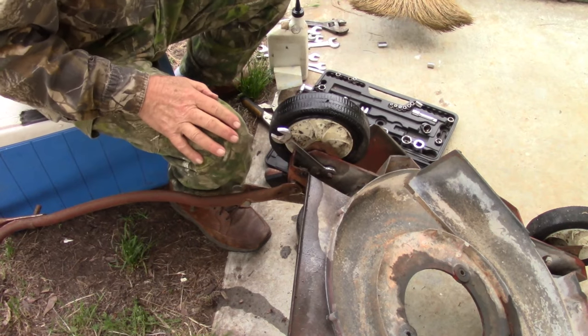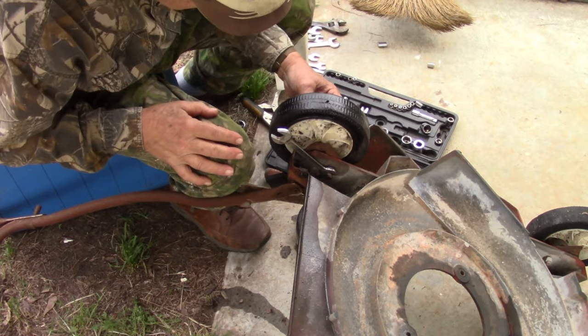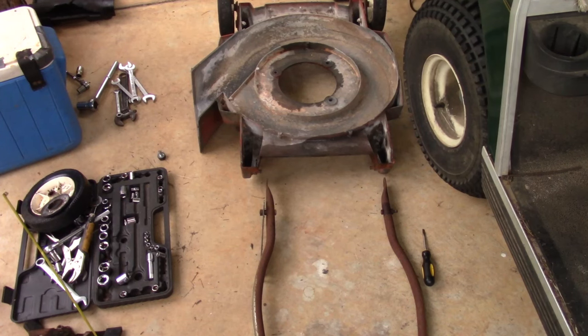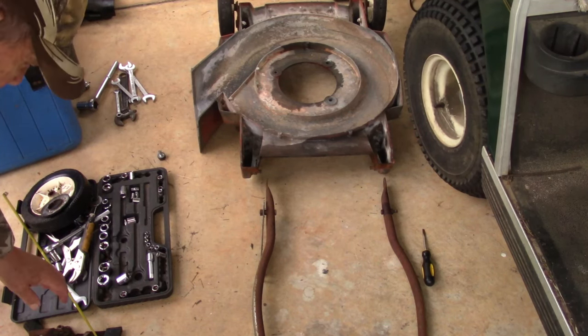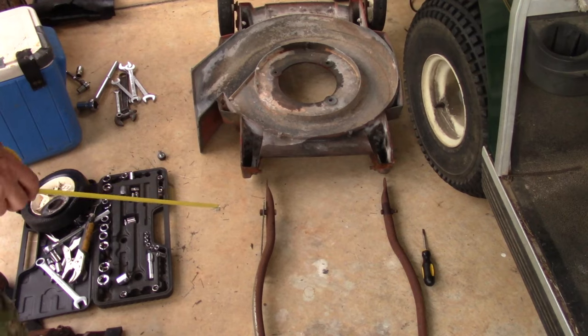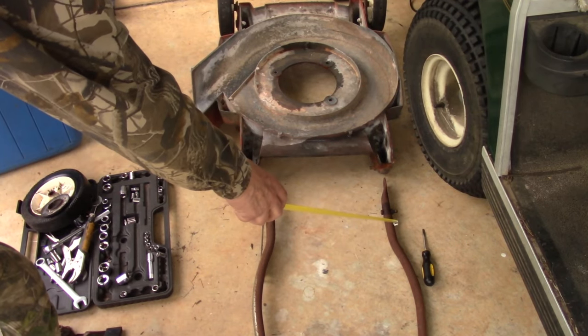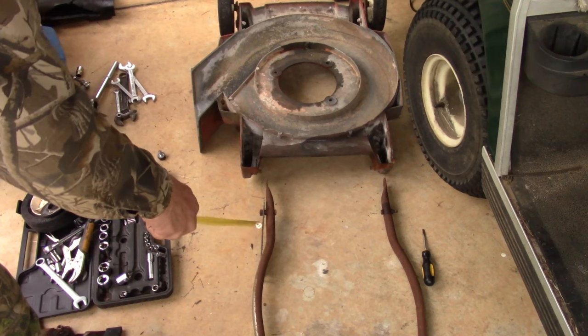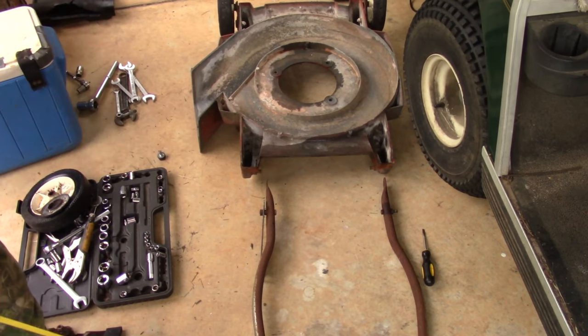Again, we're going to need to move the wheel before we can get at the other, I'm afraid. That plastic wheel was just rust bonded on that axle, and that was what was holding it. We've had warning showers and heavier rain is threatened. So consequently, I'm going to consolidate things inside on the workbench to keep my tools dry. And what we've done is we've now been able to remove the handles here. And these are the studs they attach to right there and there. And now that this bar is removed from this side, I was able to pull it free right easily.